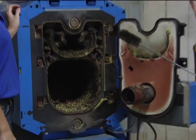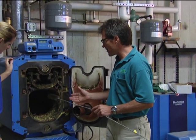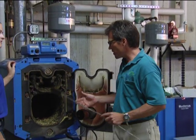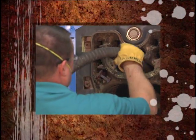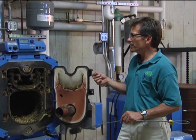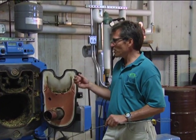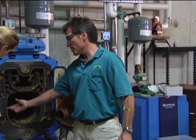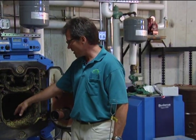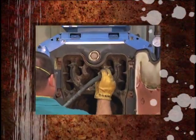With this system, the design of it is just phenomenal because we can get in here very easily. We can clean everything out from the front with a brush and a little help from the vacuum cleaner and get it down to its bare metal. Soot acts as an insulator, so you don't want insulation between your flame — the flame that comes out here, this is the business end — and the heat transfer surface right here, that's the cast iron section. So you want that cleaned down to bare metal. We do that on a yearly basis, vacuum it all down, brush it down, and on the burner itself we also replace the nozzle.